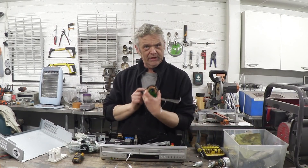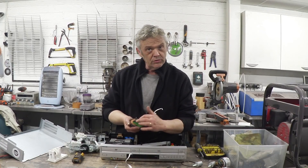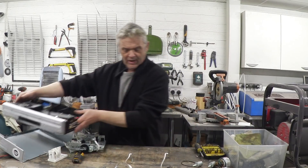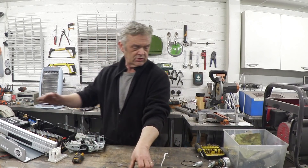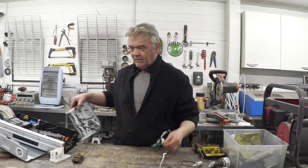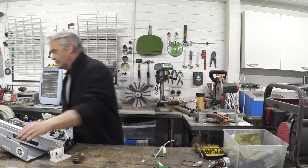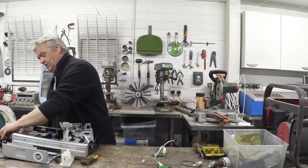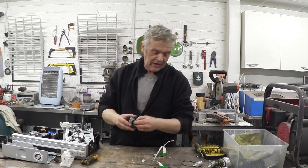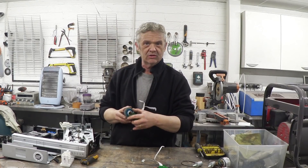It's this pulley that we're going to use. On the pulley there's a couple of screws holding the circuit board down. If you undo those two screws you can actually separate the pulley out and get two sections: the coil section and then the outer case section which is what I'm looking for. So we have the outer bit that spins and then the motor coil bit.